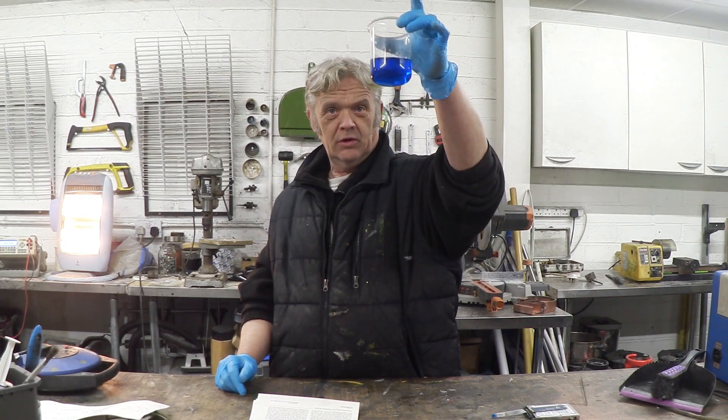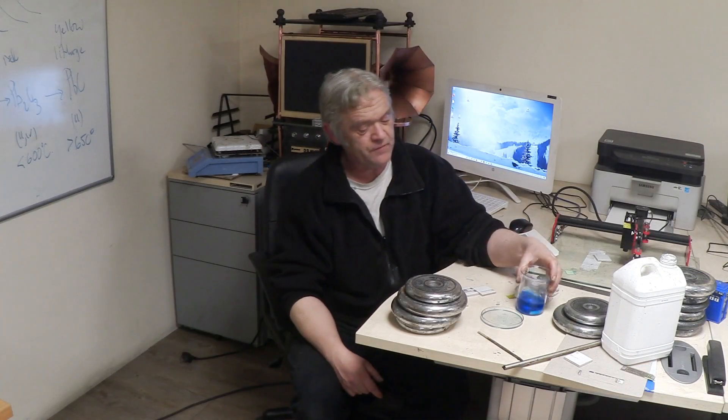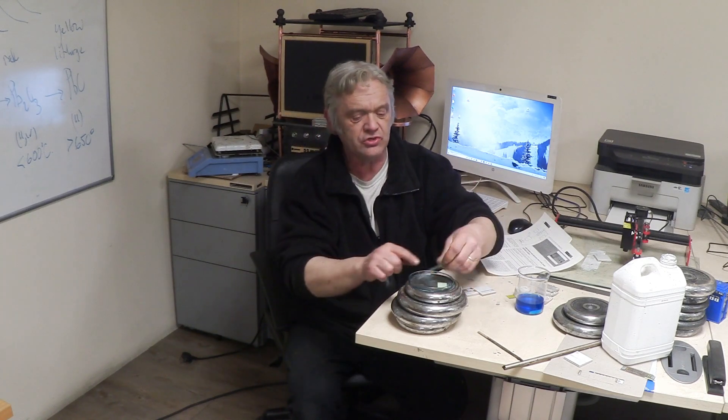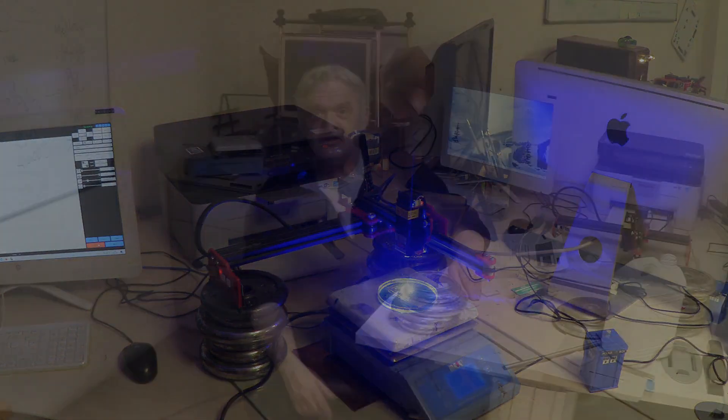It's just given there — easy to follow, just mix them up. If you don't like the sound of those chemicals, find an alternative solution. When you've done that, you should get a beautiful deep blue colored solution, because that's what copper complexes look like — this kind of royal blue. To use it, grab a petri dish, grab a slide, put a couple of bits of broken glass into the petri dish, set the slide on top, then add the solution until it just touches the bottom of the glass surface.